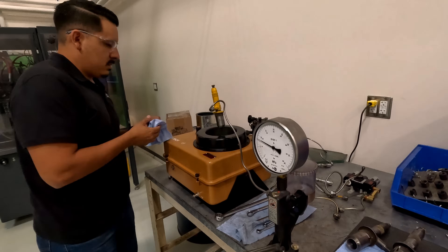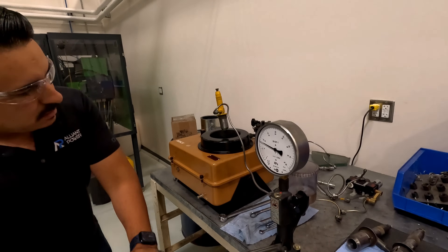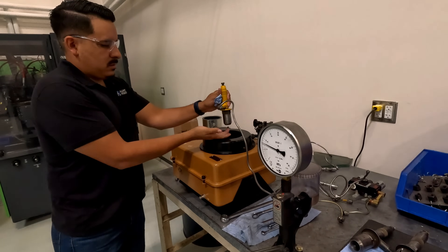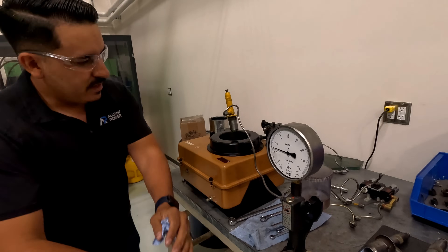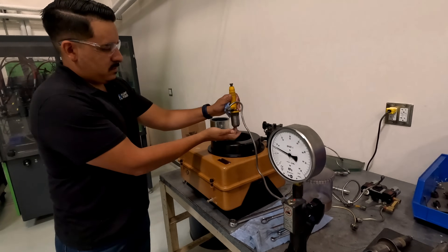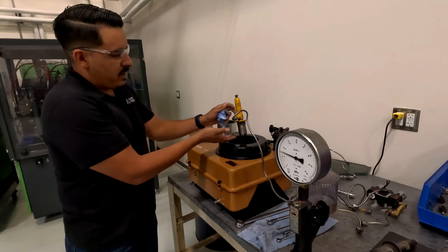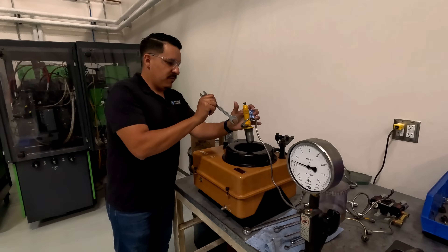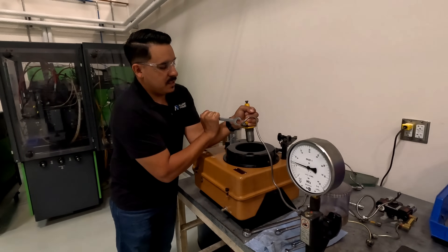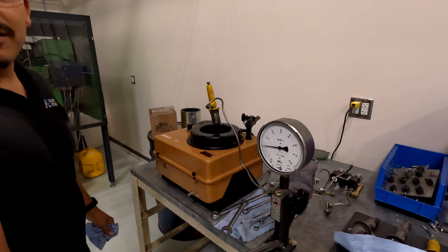That's about 90 bar. We'll do a leak test. A little bit of sweat, but to be honest, that's allowable even on the direct injected. The engine won't notice it — it'll be fine, especially on something this vintage. That one had our original service kit in it. That sounds great — that's number two.